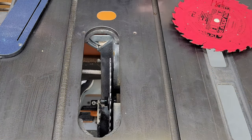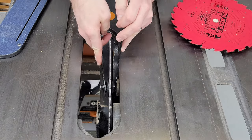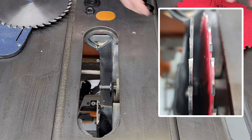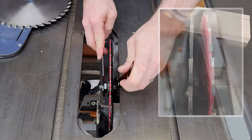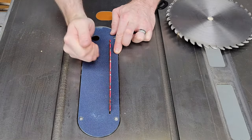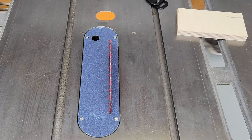It's an optional step, but before using the jig, I switched out my multi-purpose table saw blade for a ripping blade. The main difference is that the teeth on a multi-purpose blade are cut at an angle to reduce chipping with cross cuts, but the rip teeth are square at the end. Either blade would work fine, but the square teeth on the ripping blade will leave a flat bottom cut, which means you get a cleaner looking joint without having to chisel inside of a narrow groove.